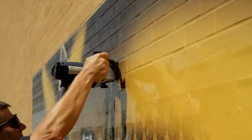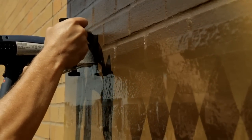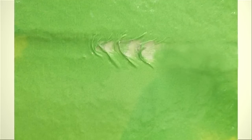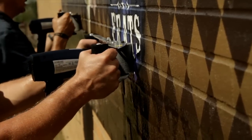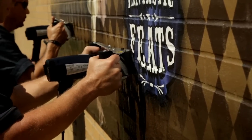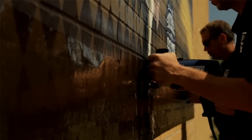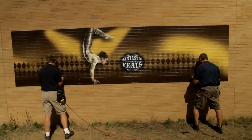A great time saver. As you move across the film, watch what you just applied to be sure you are moving at the right speed. A burned spot indicates that you need to move a little faster. Unfortunately, there is no way to undo a burn. Thanks to 3M's comply adhesive with air release channels, it's very unlikely you'll ever trap air bubbles when applying 3M's Envision Print Wrap Film. You are almost done already, and the installation is looking great.